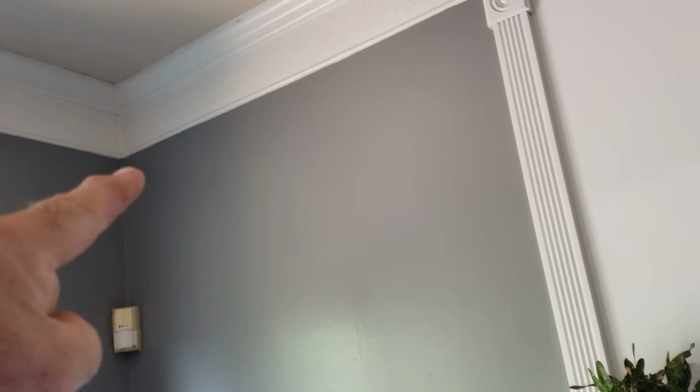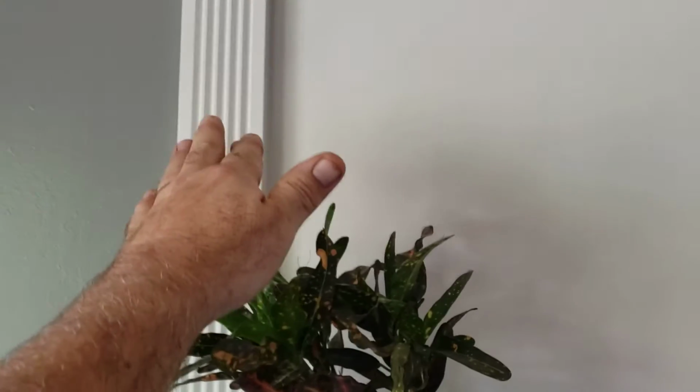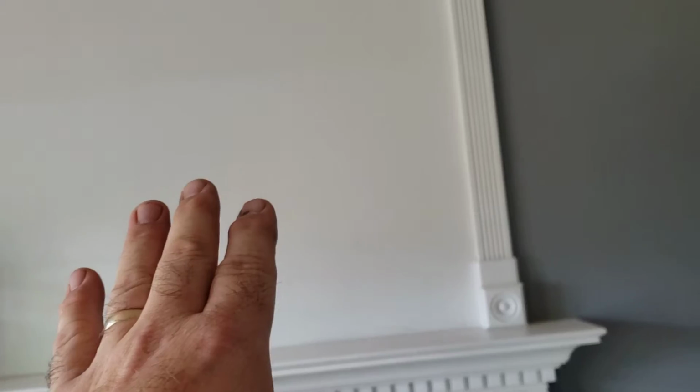Over here on this side, we're looking at like a 42-inch hutch area, 8-foot height. That's 99 inches to the bottom of that molding up there. This is actually not two pieces. This is the same sheetrock painted two different places with just some applique fillers. These are just some rosettes and some pieces that have been put on to create a vertical transition between two different colors. This piece in the middle is the same depth and plane that these pieces on either side are.